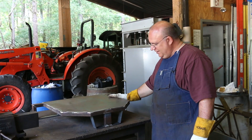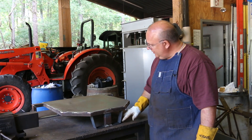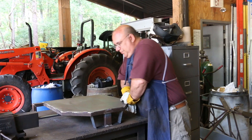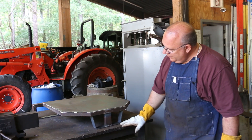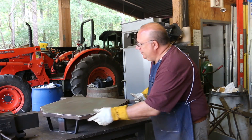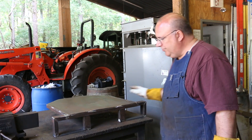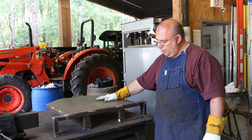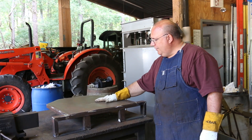What do you think about this? I think this is going to be a lot more stable. It's going to give me a wider footprint so that it's not sinking into any sand. I can still get my pallet forks in there. It's very stable now — this thing's not going to tip over. There's the front: about eight or nine inches across there as a pad across the front. Flipping around to the back — same type of thing. We've got two good feet on each side. We've got the outriggers in here now to give us more stability. It's a much more stable platform than what we started with. I'm happy with it. This is what we're going to go with. So I've got the ring ready to go on here.